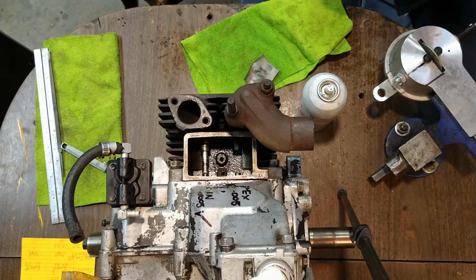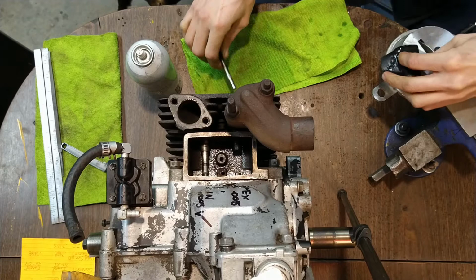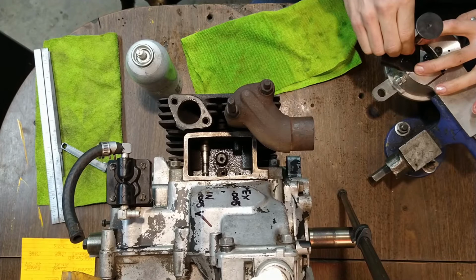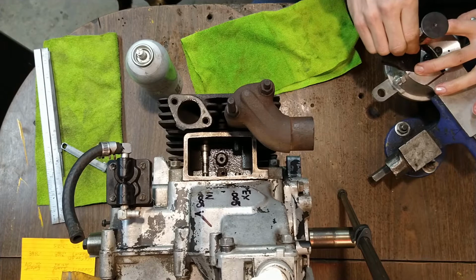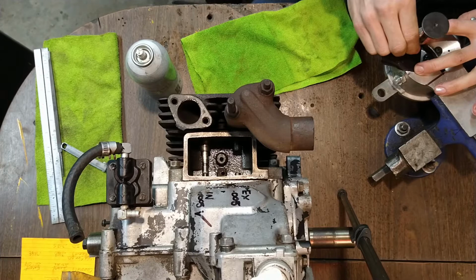I doubt we've taken another half thou off yet. Let's give it another couple rounds of this. I don't know how this particular valve was so far out. All the other ones are fine. And I didn't cut that much out of the... Actually, it didn't change that much from the beginning. Like, I was thinking, oh, maybe I just took too much out of the seat or too much out of the valve face when I lapped them, but this one really didn't change from the original measurement. And that's about where it was when I opened it up. I think it was like a half thou difference.